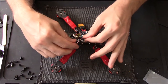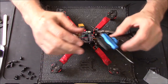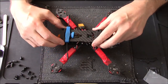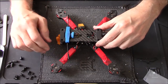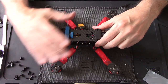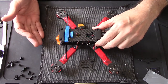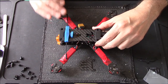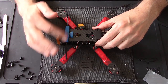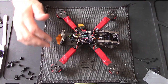These three wires are for the receiver antenna. I'm using the R9 MM, mounted on the bottom. It's not the best place for super long range, but I'm not going to be going miles and miles, so I'll get plenty of range with it. Plus you're completely protected from a prop strike — no matter which way it comes down, the props are not going to hit it because the arms are in the way. I've got one of these mounted on another quad at the bottom and it works great.